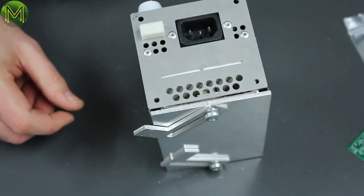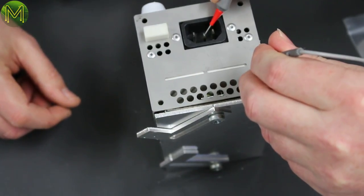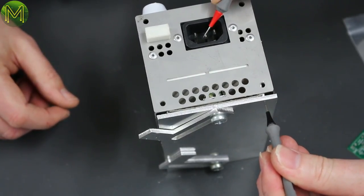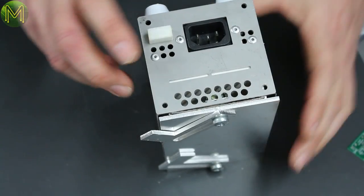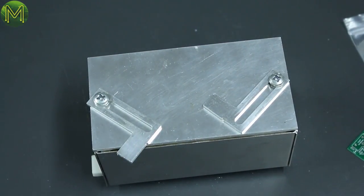Straight old buzz meter, or an ohm meter. Whichever one. Let's see whether it's actually earthed. Yep. It is earthed. Nice. And is that top bit earthed? It is. Nice. So that's earthed, and it's not going to be connected to them. The fact that it's earthed means you're pretty safe. Yep. Even if it goes bad and takes out all my servers, it blows the fuse.